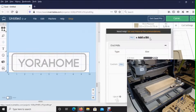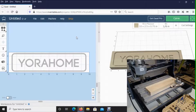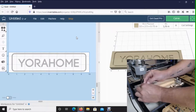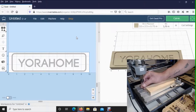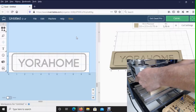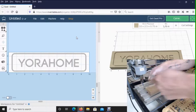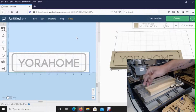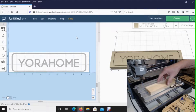Second is the bit — make sure you're putting in the correct bit you've chosen. I have here a one-eighth inch upcut, which is the most common one I use. I'm going to go ahead and put this bit in, get it in there, turn it down, and make sure it's pretty snug. It doesn't have to be over-tightened, just make sure it's good. So I now have my eighth-inch bit in and everything is correct.